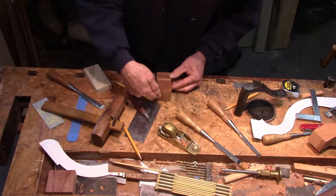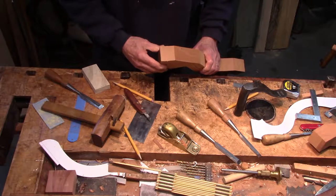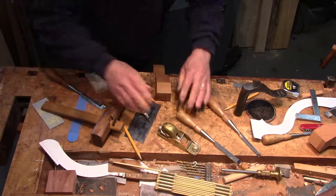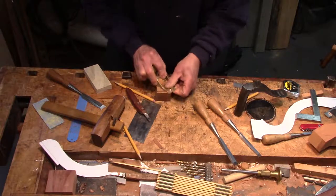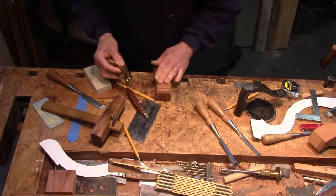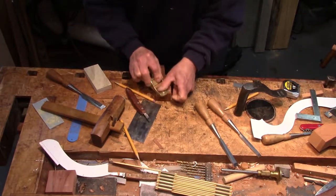and so the dovetail needs to go back 9/16 in depth. So I notice I should flatten this as well. This is a bandsawed surface, and a little bit rough, so a little bit of hand planing will give a nice flat surface up here.